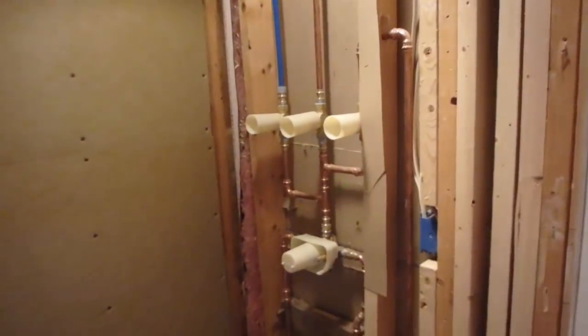So all these seams, anything less than 1/8 inch gap, like this, maybe 1/8 inch, that's about 1/8 inch. Anything more than that, you have to fill with thinset before you waterproof it with the Hydroband. But because that's right around that 1/8 inch, I don't have to do that. So I can just coat that afterwards and it'll be good. So I'm going to put this piece on now.